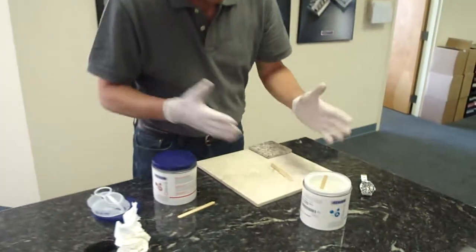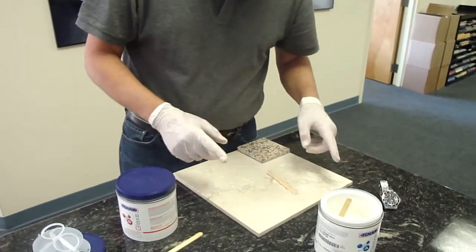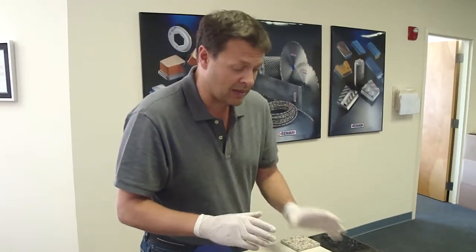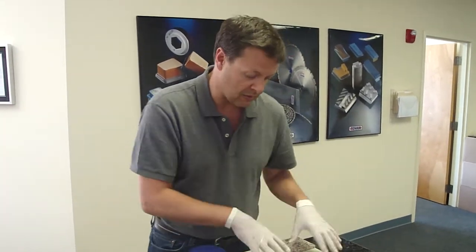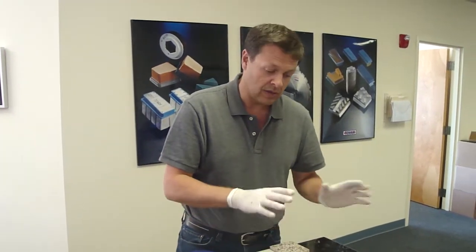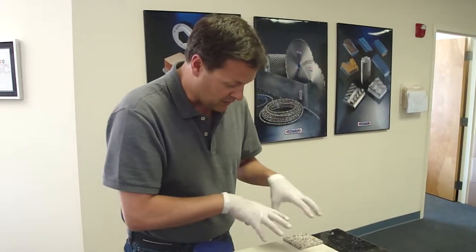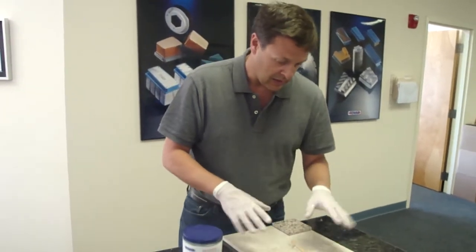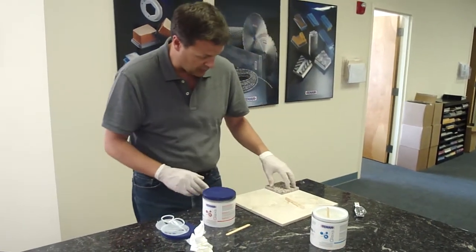The application is for gluing together two pieces of stone. One thing you guys have to be clear on is that the pieces of stone must be dry. If there is humidity or water, the glue will not work. So priority number one: make sure it's completely dry and clean, then you can start mixing it, spreading it, and gluing it together.